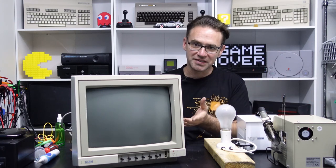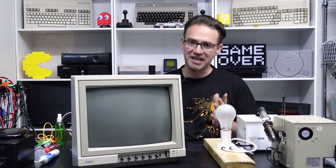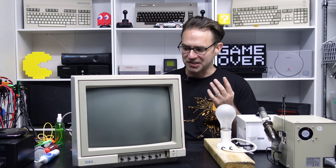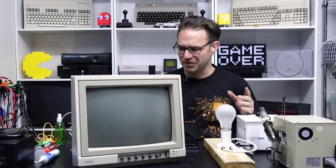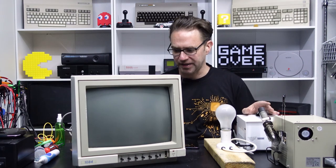I've reassembled the whole thing and we're going to try and power it on again. I doubt it's going to work yet, but it'll be interesting to see if there's a change. I didn't find any damaged components — I did some basic tests on most of the electrolytic caps, diodes, and transistors; nothing seemed shorted, everything seemed still within spec.